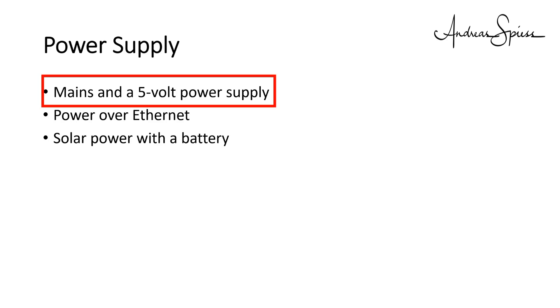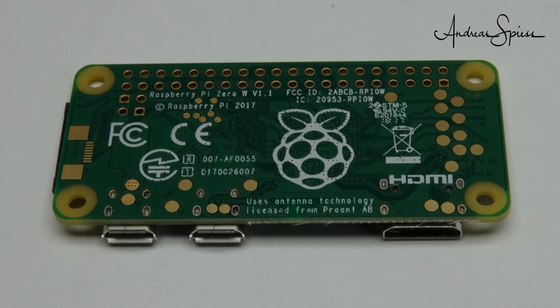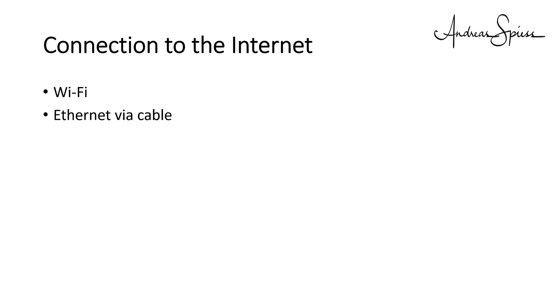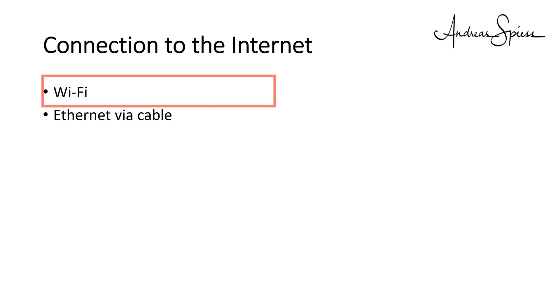My choice is mains and a small 5V power supply. For the network connection, you have two possibilities: Wi-Fi and Ethernet wire cable. If you want to use Wi-Fi, you have to use a Pi Zero W and have a Wi-Fi network in reach of the Raspberry, which is not famous for its Wi-Fi antenna. If you want to use Ethernet, you either go for a standard Raspberry which already has an Ethernet connector, or you use a USB to Ethernet adapter. Combining an Ethernet cable with PoE is easy, but pay attention if your gateway is outdoors — you have your delicate Ethernet network extended to an area where lightning can occur. This is also why I use Wi-Fi.